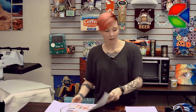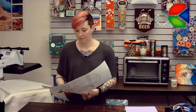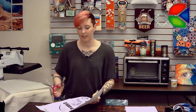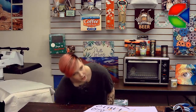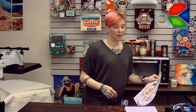Thank you, Bo. Good looking out. I was just about to answer that question. So does the white coated steel work at the lower temperature? So I recommend all of the steel be done at 360. All of the steel, I would say do it 360, and then all of the ceramics do it 400. But also find out what works for you, because it's just like on recipe instructions, it says the little blurb about high altitude and things like that can affect your cooking time. It's the exact same thing with sublimation, so always just find out what works for you.